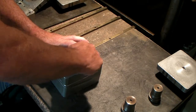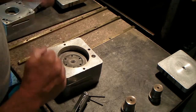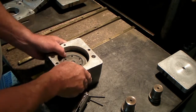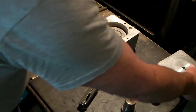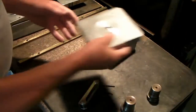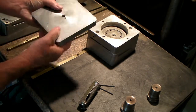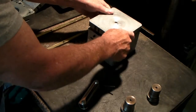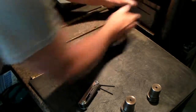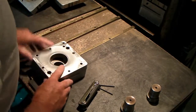And I don't tighten it very tight. Just snug is good enough. Don't try to make them too tight, because when that aluminum expands, it's going to really get tight. So just snug is good enough. It won't move. When it gets hot, that'll be tight in there. And of course, this is another mold that's made with the little spring washer, so the air is used to open the mold. So that one's all set to go. So that would go into the press. And it's going to be exactly the same with the other one.